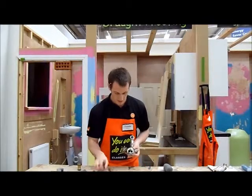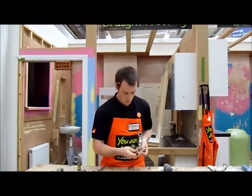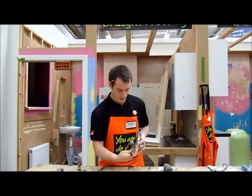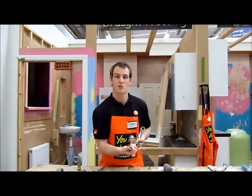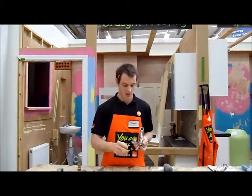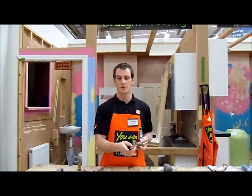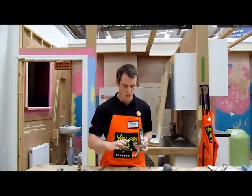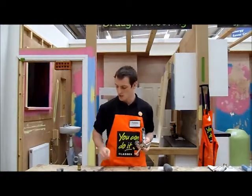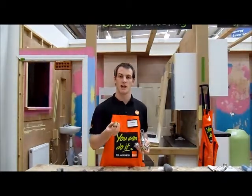Once you have it fit, you can get your tails, and these ones here just screw in. Now in Ireland, we use 1/2 inch pipes and 3/4 inch, so we still use imperial measurements. However, in Europe they use 15 mil and 22 mil, so metric measurements. So if we try and put our 1/2 inch pipe directly onto this, the fitting won't work. So what you will need to do is to get fittings that go from 15 mil to 1/2 inch.